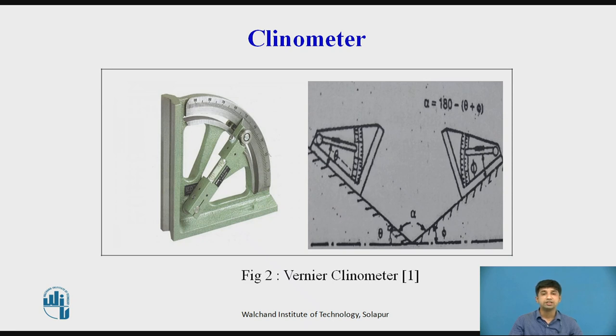The scale may cover the whole circle or only a part of the arc, and is generally used to determine the angle included between two adjacent faces of a workpiece. The base of the instrument is placed on one of the surfaces, and the rotary member is adjusted until a zero reading of the bubble is obtained. The angle of rotation is then noted on the circular scale against an index.